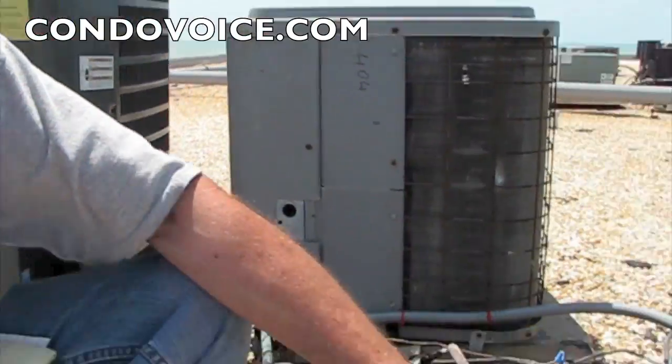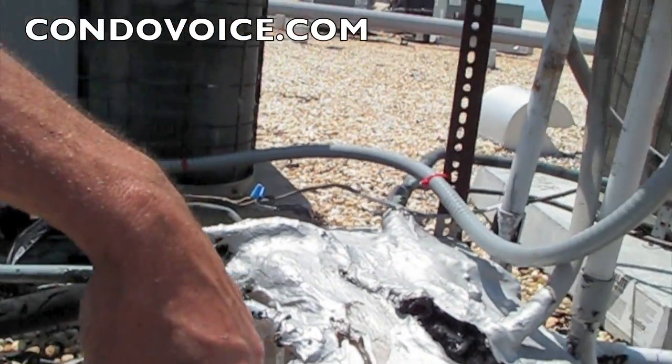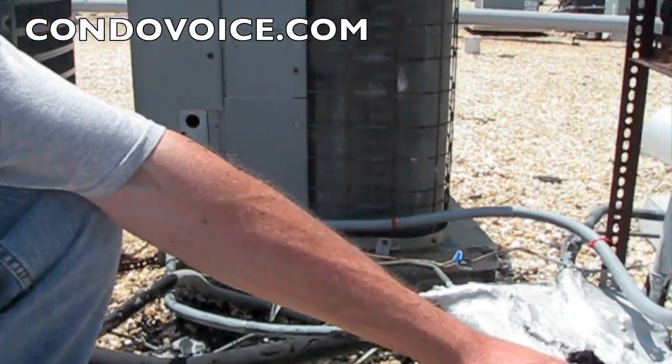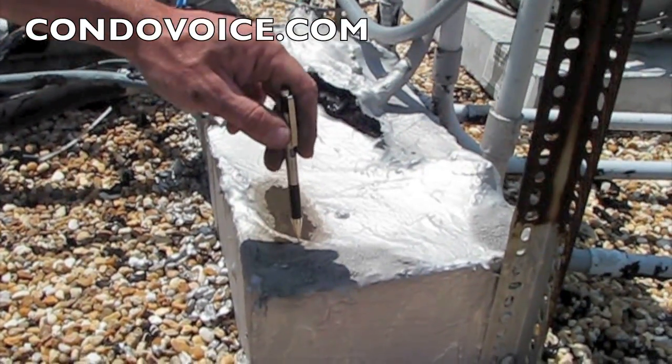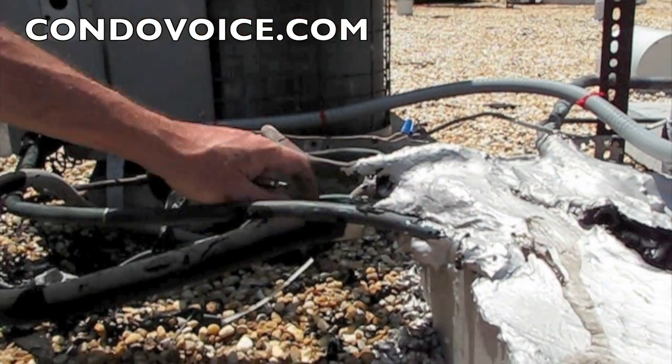The other issue here was a pitch pan. That's where all of the pipes — the Freon pipes and the electrical pipes — go down into the building and then on into the units. Any conduits or anything that comes penetrating through the roof are required to come through a pitch pan. These pitch pans are bonded through a roofer to guarantee that they don't leak. Anything that comes up through a commercial roof has to be bonded by a commercial roofer. What we had here was one of the old whips going down through the pitch pan tar and coming out the other side.